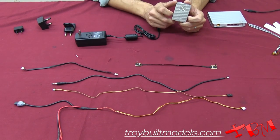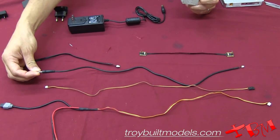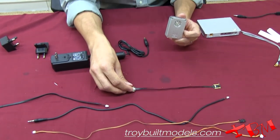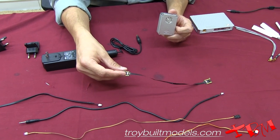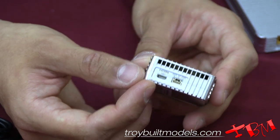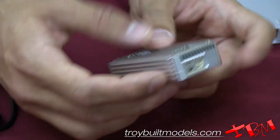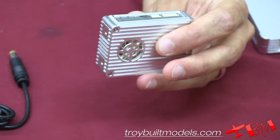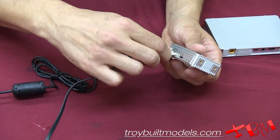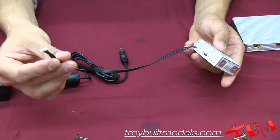There are a few ways to get video feedback from the air unit. First, we can plug directly into our gimbal control unit using an analog cord. We can also use the micro HDMI, which is designed for the GoPro, and go straight from the micro HDMI to the camera to have live HD coming directly from the camera. Our last wire supplied with the air unit is the gimbal port, made specifically to work with your Blackmagic gimbal, GH4 gimbal, and any future gimbals that DJI will be releasing.